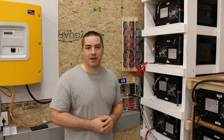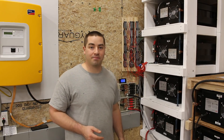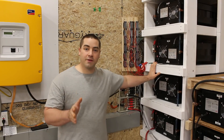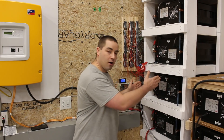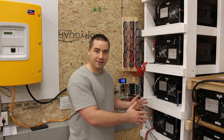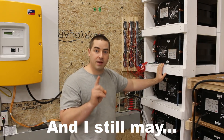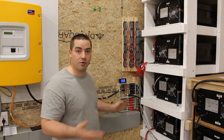This pack is still very new for me — I've only had it connected to the inverter a few days — but there are already things I would do differently. I really enjoyed putting together the copper bus bars on my buddy's packs and wish I had done something similar on mine. If I did this again, I would probably wire the bottom four batteries with all positives together and all negatives together, paralleling the bottom four modules, then do the same for the top four, and make just one connection between the two groups and one connection back to the bus bar or inverter.